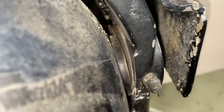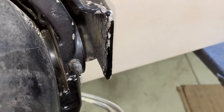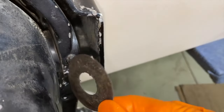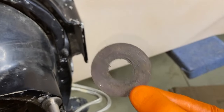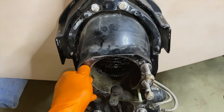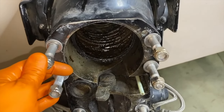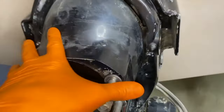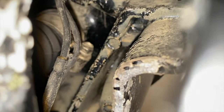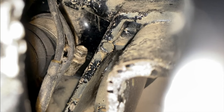There is the port side hinge pin. Carefully pull these out — if you're going to reuse them, make sure you don't damage them. Set them in a safe location as you work through the remainder of the project. At this point, the bell housing itself is extremely loose. The only things holding it on are all of the bellows: the U-joint bellow and the exhaust bellow. We are going to shift this to port side. Come inside here — you have a bellow for your shift cable inside there, and as you can see, it is clamped on and secured in place. We need to loosen up that clamp.